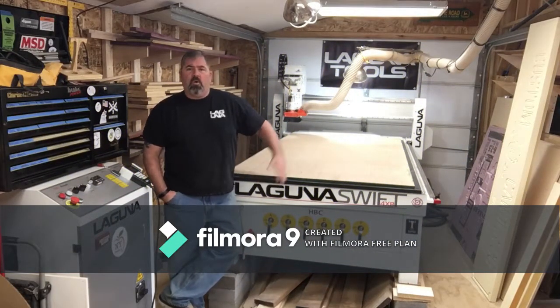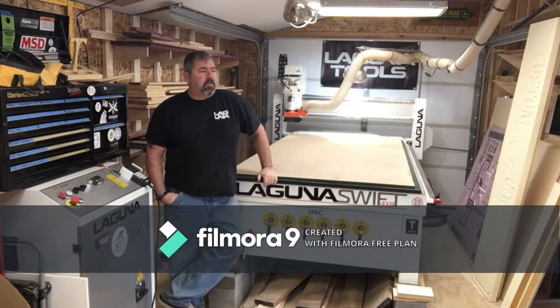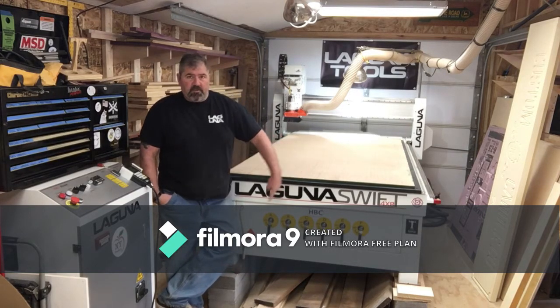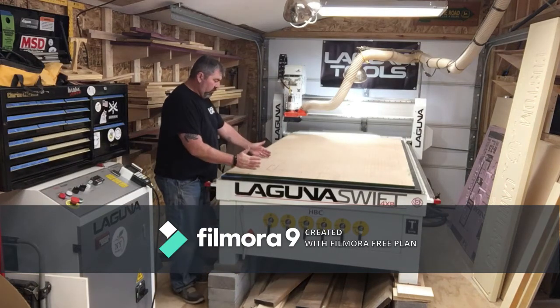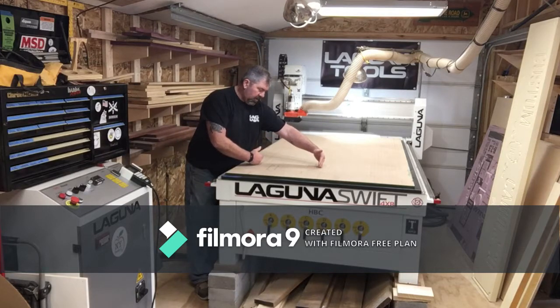Okay, now we're back all the way on the other side of the shop. The table saw is over there. That's where you were. You can see that from the shop tour if you followed along there. And this is my Laguna 4x8 Swift CNC table. It does have a vacuum table, as you can see by these valves down here. There are 6 valves and there are 6 zones. Each zone is a little over 2.5 feet, and they're split in two.